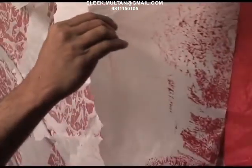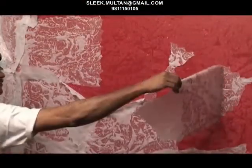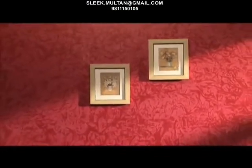Remove the butter paper after three to four minutes. A handy tip: in order to avoid formation of joints and a uniform pattern, the application on the corresponding section has to be completed before removing the butter paper from the current section. Now complete the entire wall in the same manner and you are ready to see the dapple effect on your wall.